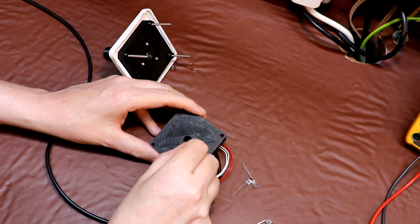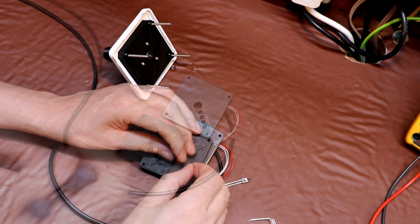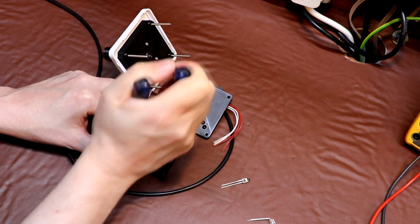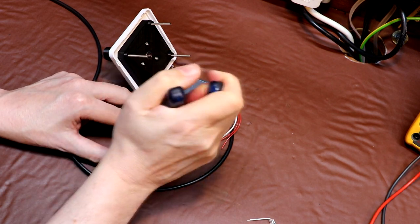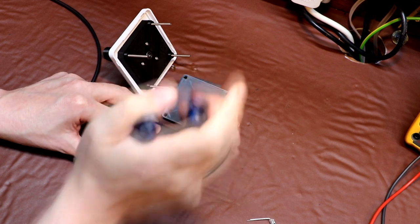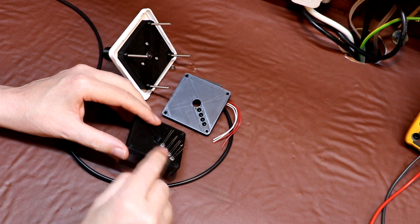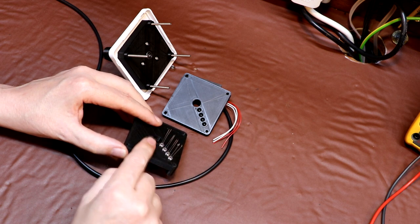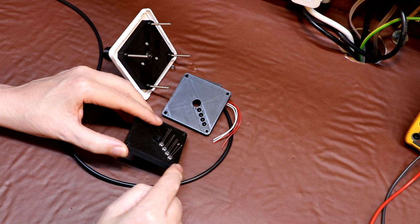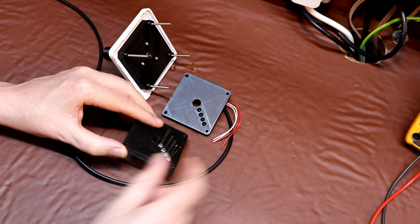So let's go ahead and install our LEDs. Oh, that one seems a little bit tighter than the others. In a perfect world, I probably would have wired up all of these diodes in series, but unfortunately the voltage drop across each of the LEDs is just too high to run them from a 5 volt supply, because it would just about exceed 5 volts. So the way I'm running this, I've got 3 of the LEDs connected in series, and then I've just got one on its own.